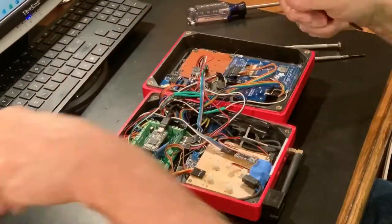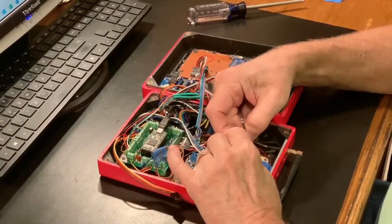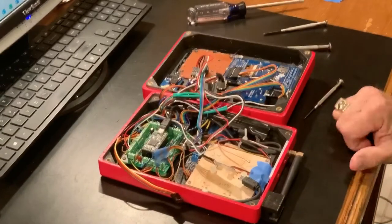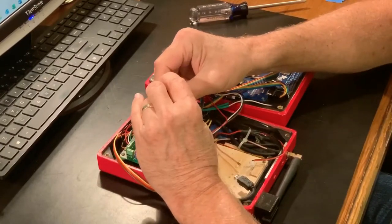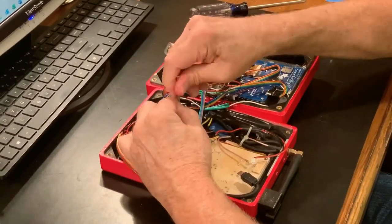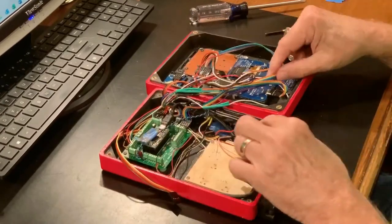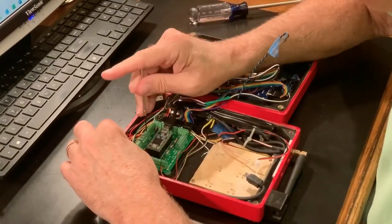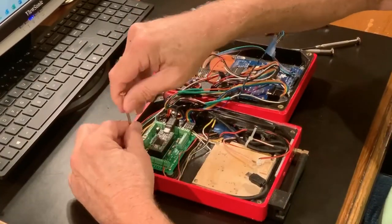As you can see from some of the wiring, I've made good use of DuPont connector wires. They're simple, they interconnect well, and the male end terminals fit well into the screw jacks on the main CPU board. Changing over from the screw connectors to JST connectors will be a little more work building cables, but in terms of maintenance and assembly, a lot quicker than dealing with these dozens of very small screw connections.